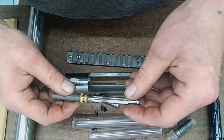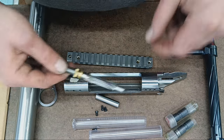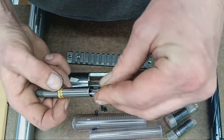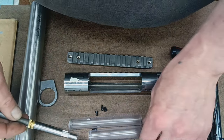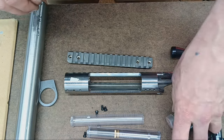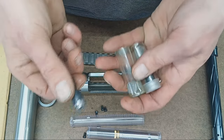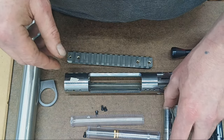And you basically cut a little bit and then you measure and cut a little bit. And once you've hit your dimension, then you're done. It's kind of a foolproof way of not blowing past your desired throat depth. Other than that, typical belted mag cartridge. So we've got our standard belted Magnum go and no-go gauges to check headspace at the end.